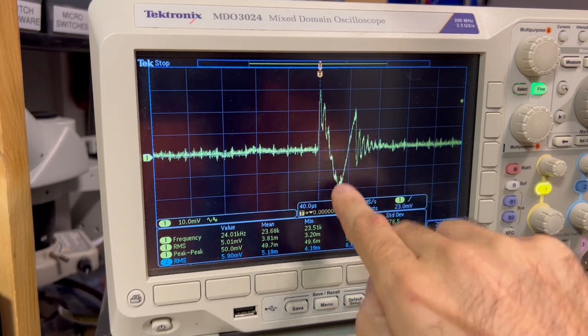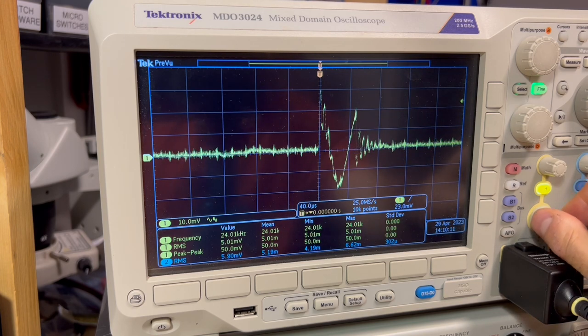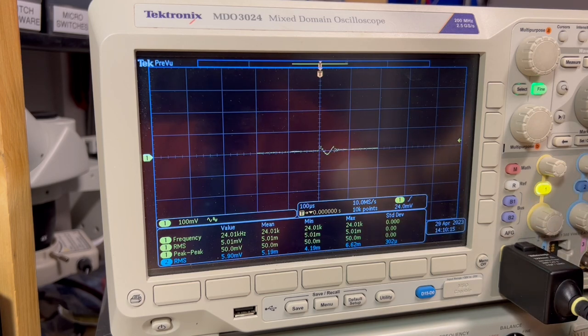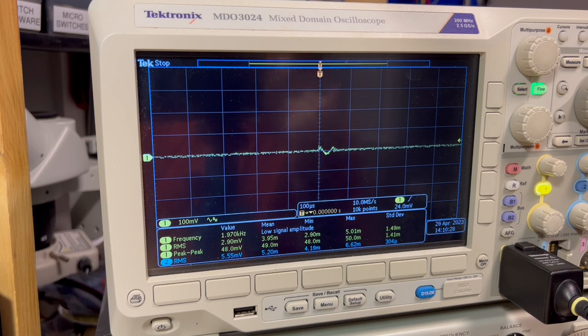I had to raise the output to 6 volts peak to peak. Looking at the same 100 millivolts per division and 100 microseconds setup as before — we were unable to get any ringing until we got it up to 6 volts. And even then, what we see here is almost not really even a ring at all — just an initial pulse that decayed away quite a bit, and maybe a tiny bit of ringing but clearly not the ring pattern we had on the good transformer. Based on being unable to get any response at 3 volts and needing 6 volts to get even a poor response, this tells me there are more than likely shorts on the secondary side of this high voltage transformer.